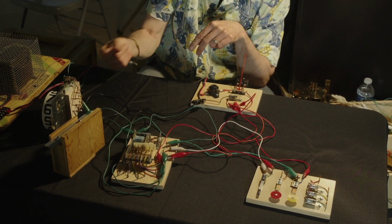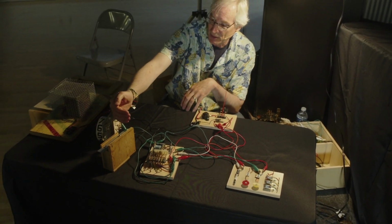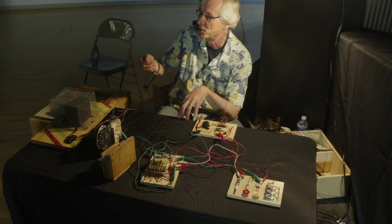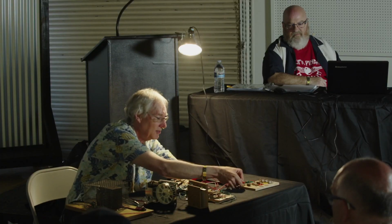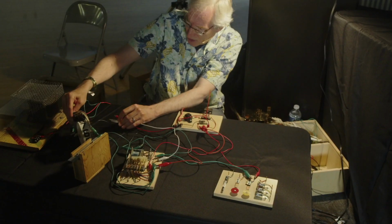And it will seem like it's happening instantly because it happens so quickly, but it's actually extending the time that relay is active to the time that it takes to pull that plunger all the way back. And once I'm all the way back, that's all the work I need to do. I can let it go. So I'll just take this switch out of my circuit, and I will use the end of stroke switch.